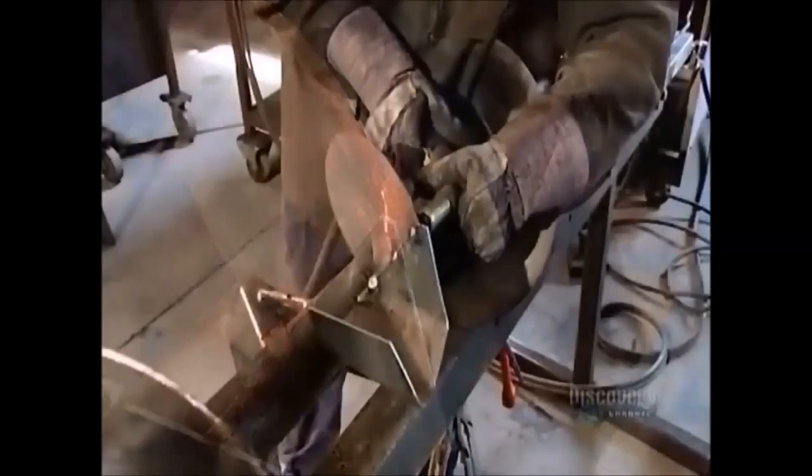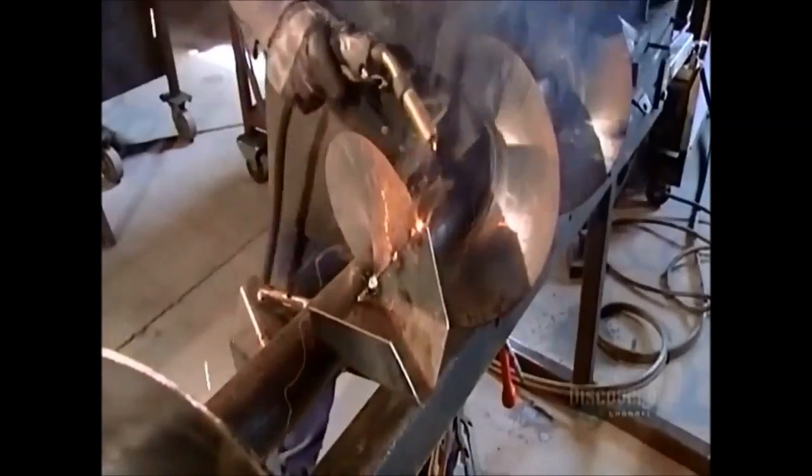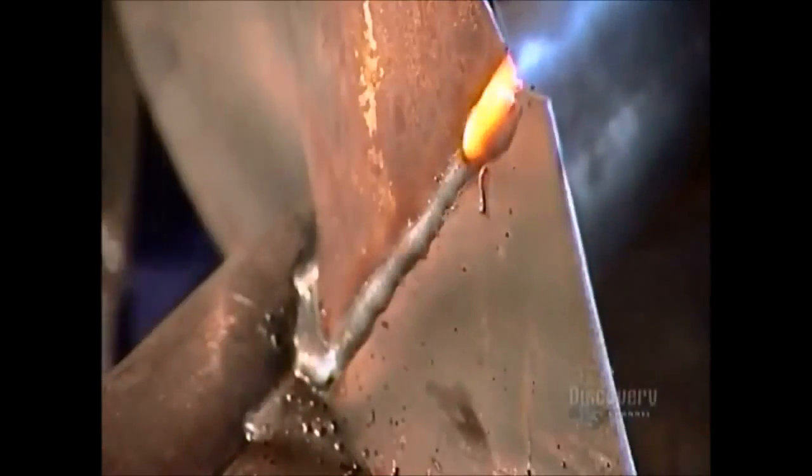The paddle is a critical part. The flightings will feed ice shavings to it, and the paddle will then toss them to a bin mounted above a water tank to be disposed of later.